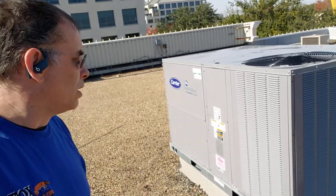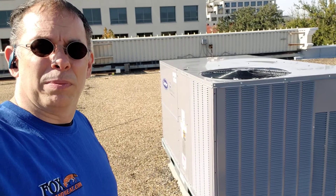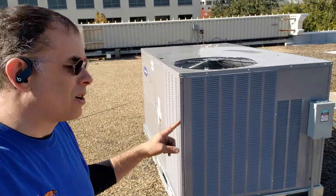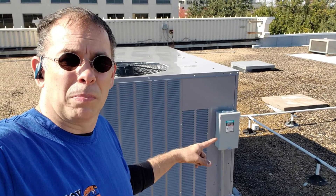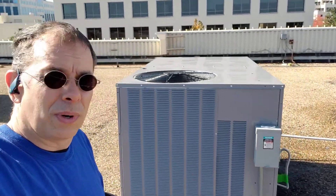This six-ton is actually two stages, so it fits on a five-ton curb. And we've got hail guards on this thing. A lot of these units you'll see people cut corners on commercial stuff — you've got to do extra. You've got to do hail guards. These electrical disconnects were old on the unit. We just had another unit where somebody burned up a compressor and we had to go put in a new compressor and an electrical disconnect.